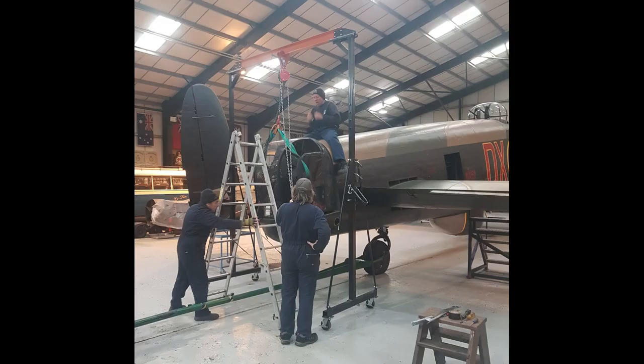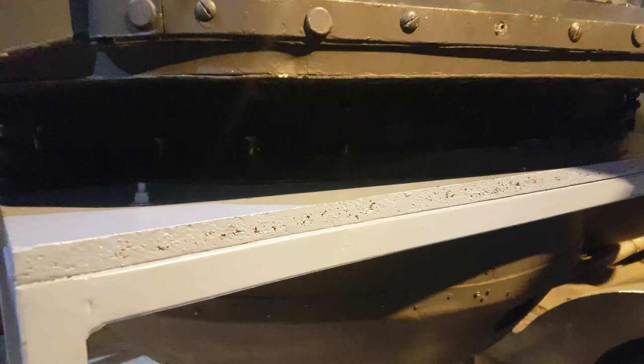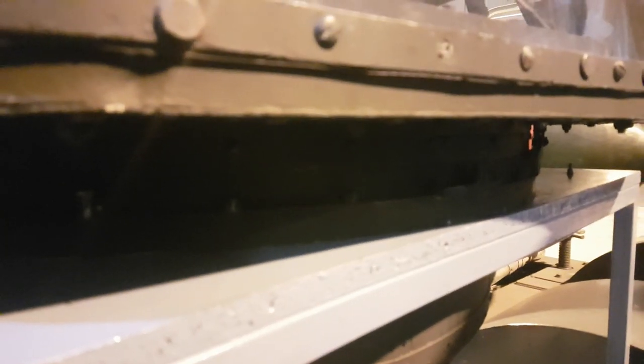The first bits that have to come off are the rear turret. The rear turret is held on by a series of nuts and bolts across the bottom ring, which is held into the fuselage onto the spun steel ring that we had made and fitted last year. It's lifted out through the top — the turret has to manoeuvre slightly as it comes out to allow the bottom rotation joint to come out of the aircraft as well. It can then be lowered out onto a pallet, which makes the aircraft very clear at the back.